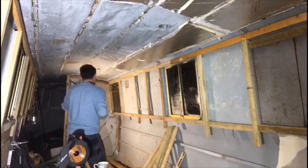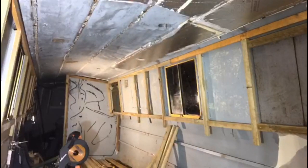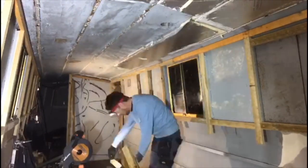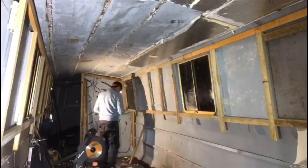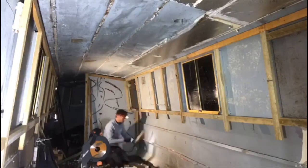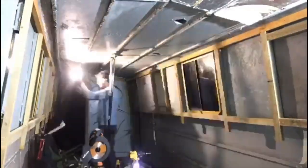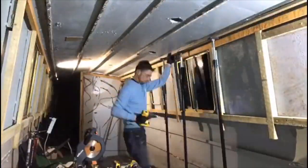I needed to prepare the timber battens for below the gunnels. I had a few ready and the first one went in really easily — well, it took one drill bit to get through the two holes. But the second one caused me real grief. I went through three more drill bits trying to get through the six-mil steel, before finally thinking I need to do something else. I couldn't dwell on it, so I started scraping out the ceilings and putting battens on using grip fill extra and self-tapping screws, which went up nice and easy.